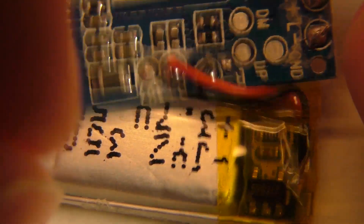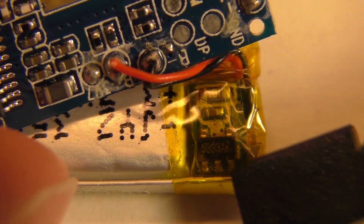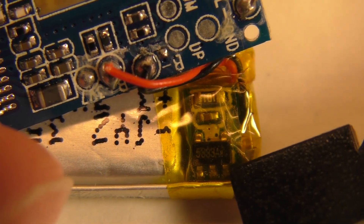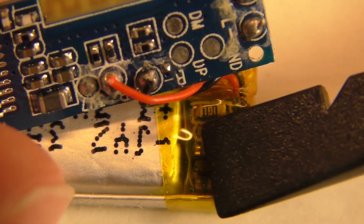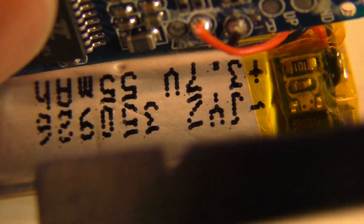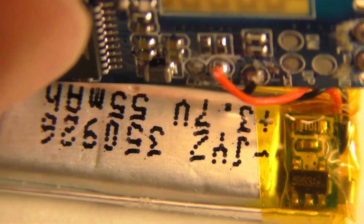However, in the battery itself there is a little circuit board on the battery which has a little five-pin chip on it — I'm not sure what that is — and there's a resistor here which presumably sets the charge current or is being used as a shunt of some kind. But anyway, that cell does appear to have protection on it, which is a good thing. As I mentioned, it's just a tiny 55 milliamp hour lipo.